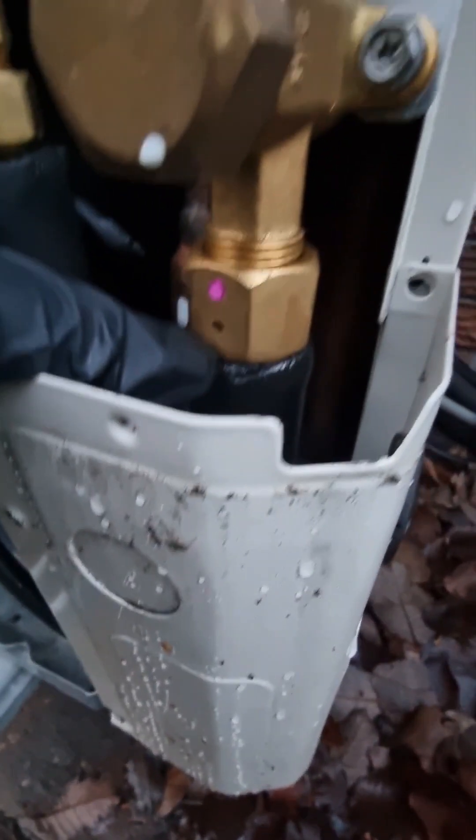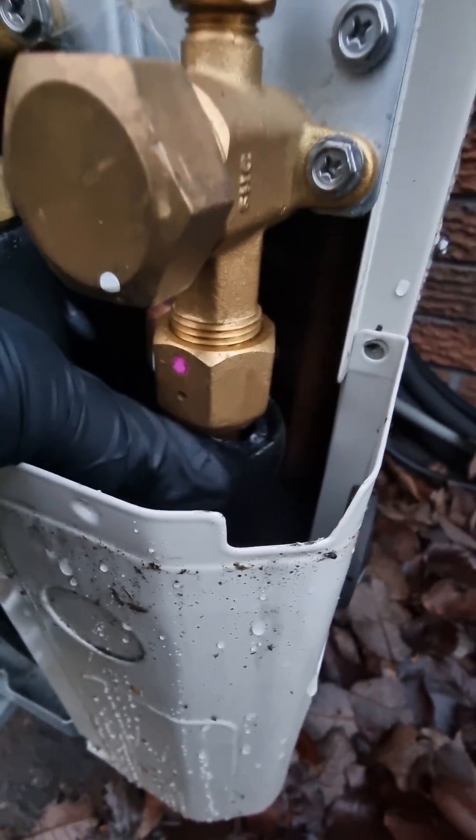Let's go to the outdoor — there's a larger twin-split unit. That's my gauge on, and you can quite clearly see we've got oil there. So that's where it looks like the leak is. We'll power this down and get it fixed.